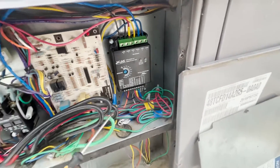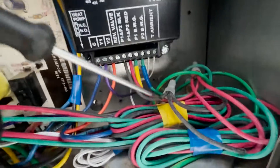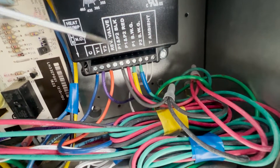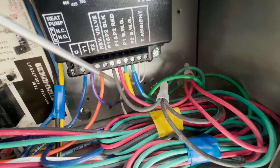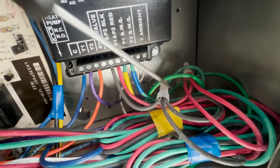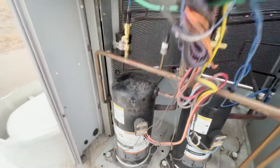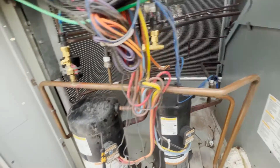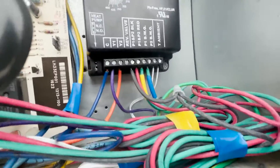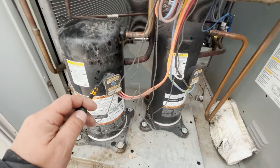These take more effort than I always think they're going to. We have our pressure transducers in — a blue and a yellow — and they're marked on the green wire. The blacks need to go together; I dead-ended them because getting more than one wire in there with wires sticking out everywhere is a pain. Red is the same deal — dead-ended. Then we have our individual signal probes, one and two. Blue and yellow correlate to each circuit, but we'll swap those because the yellow probe is on our secondary compressor.